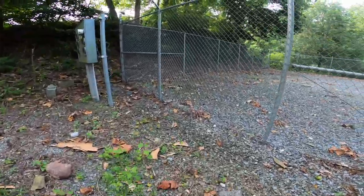Again, I'm gonna go 30 inches of depth to be safe. Ground ring, same thing, 30 inches. And no inspection, but I still wanna do it the right way.